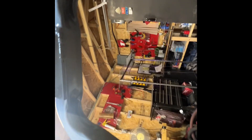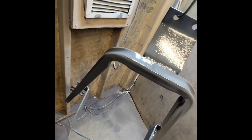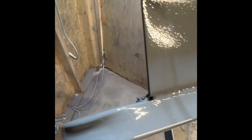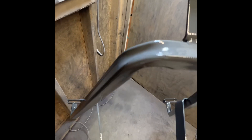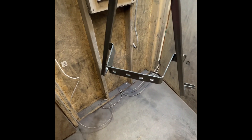I use the mist coat to get into these crevices. It's the best way I've found to just pull it out hot and give it a spray down into these deep grooves, because you're not going to be able to get in there when you're just doing powder to it. Powder doesn't stick in those areas — it's really hard to penetrate in.